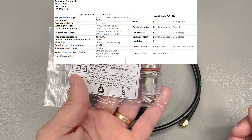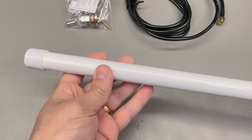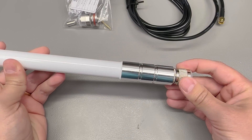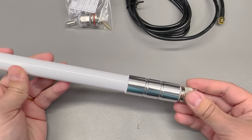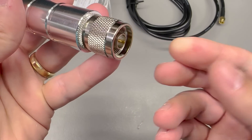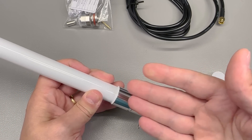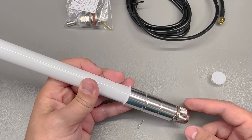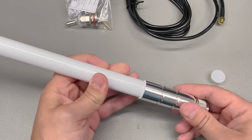Next up I got this big antenna which doesn't quite fit in the frame — it's 55 centimeters long, rated for the 868/915 MHz frequency band, which covers my needs for 868 MHz LoRa in the EU. The antenna comes from AliExpress from a company named Star RF, so I'm not sure it will meet all specs, but they claim 10 to 12 dBi gain and an SWR of less than or equal to 1.3, putting it right in the middle of the desired range. It has a male N-type connector.